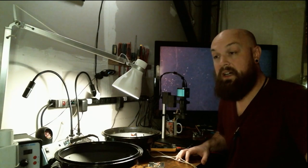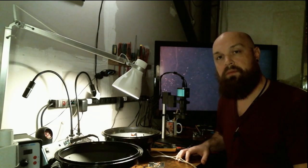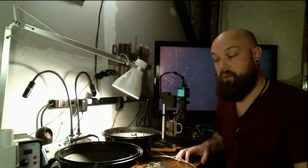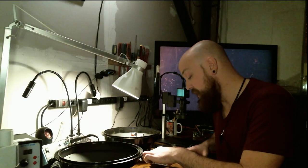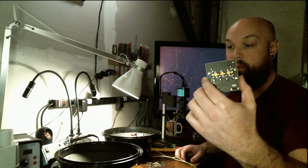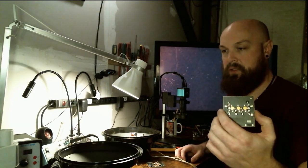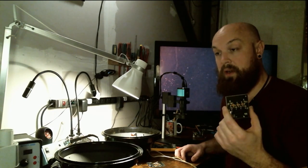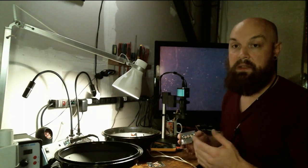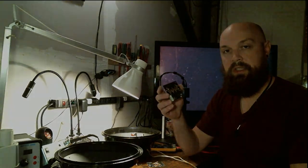Now we've tested two more LEDs, and one of them shows some lights when we put it into test mode. We can see on the physical board it was this one — when we put our meter into diode mode, we could see the lights turn on. So what I want to do next is check the power supply to see if it's outputting the proper voltage to drive this.